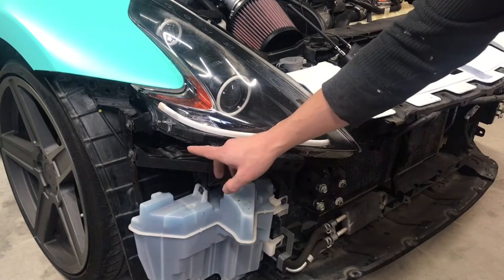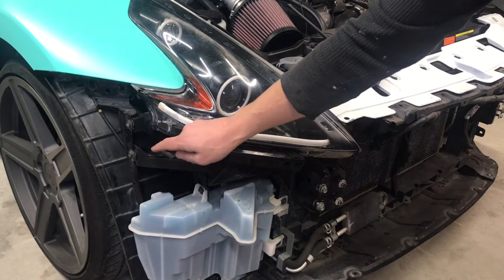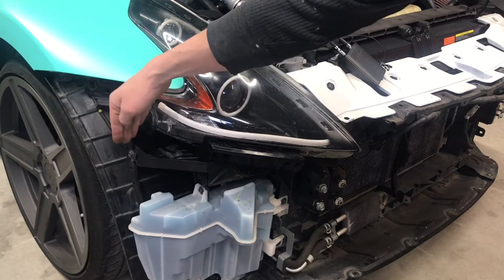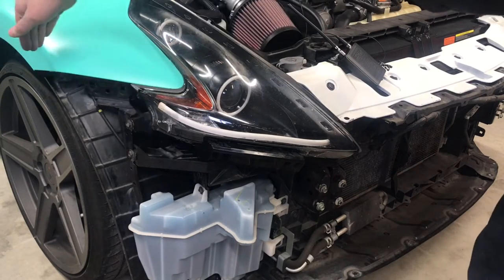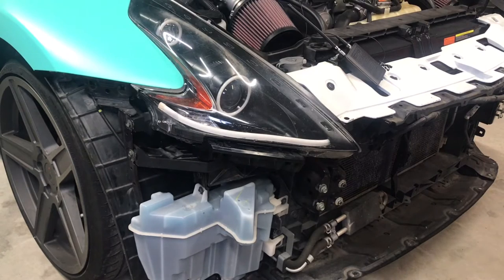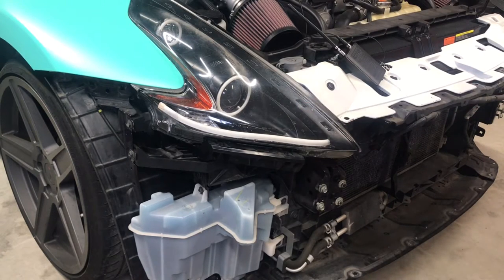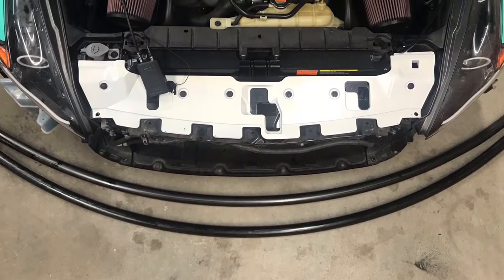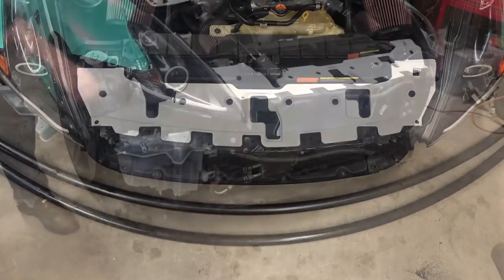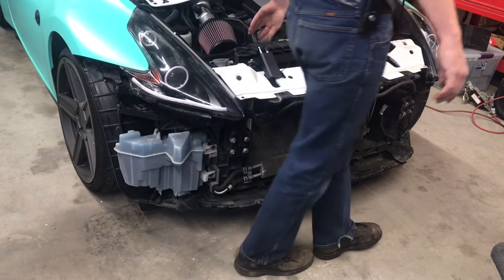Now one thing that I'll have to keep in mind is when I'm measuring out this length, I'm going to have a bend somewhere in this area here. So from about this area here back, I need at least a long enough leg that I can put it through the tube bender. So a foot will be more than enough to compensate for being able to clamp on one end and have it roll through the die without it falling off or anything like that.